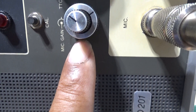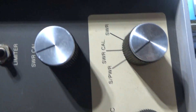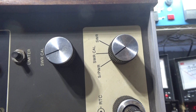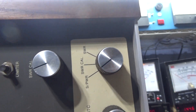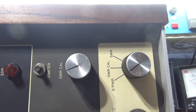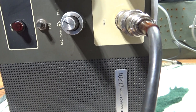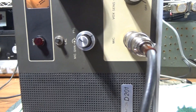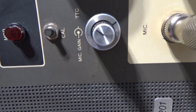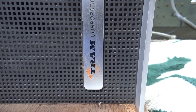In the place of those two VOX knobs, the later versions put a single adjustable noise blanker knob. On this radio you've got a limiter over here, and I'm not sure - some of these did have a blanker in them and some did not. On the original ones, if it had a blanker, the limiter switch would turn on the automatic noise limiter and the blanker at the same time. The next generations had a variable blanker over here. That's the difference you can physically see on the outside - the hardwired has the VOX, and the mic gain and tone control are over here.